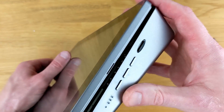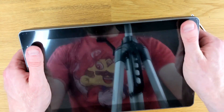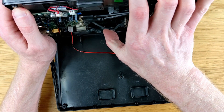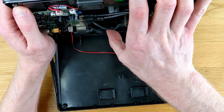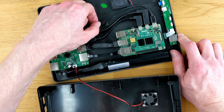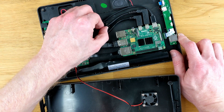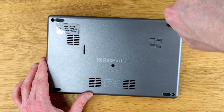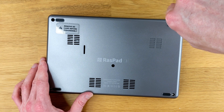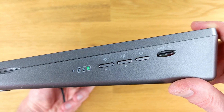On my Raspad, the back closed up fine, but the front wasn't closing. I opened it back up to check it out. I initially thought it might be the USB cable pressing the frame out, but it turned out to be both HDMI cables covering the final screw hole. There are two little posts inside to route the HDMI cables around — I missed that step. After moving those cables, the Raspad closed without issue and was basically assembled and ready to go.